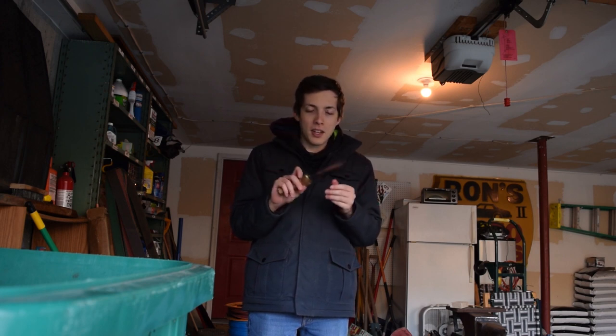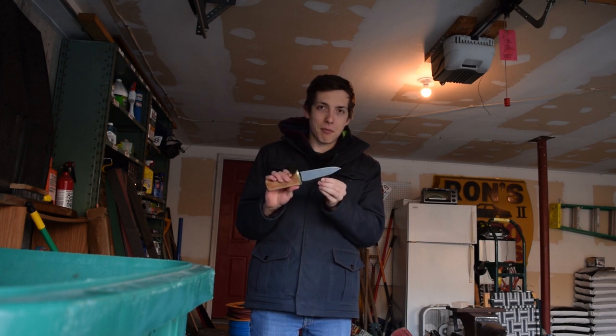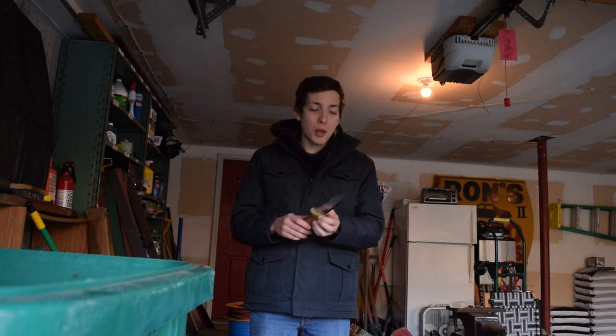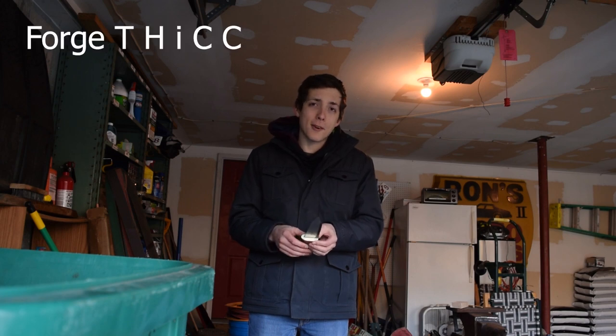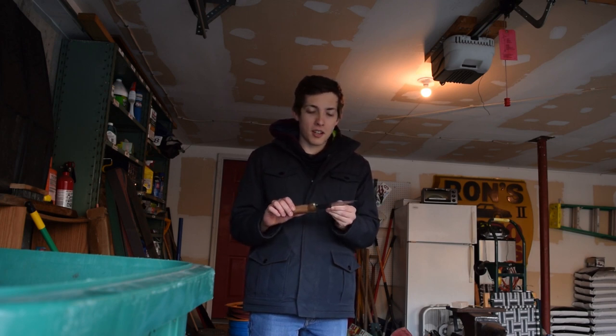I'm going to call that a wrap. I'm very happy with how it turned out, despite not going exactly as planned. I got some more tapering towards the tip than I originally intended — because I botched the quench with an extra thin blade that ended up warping, I had to grind way more material off the blade during post-quench grinding than I would have if I had just left the blade thick. So the lesson learned through failure and experience is: forge thick and grind thin. That's especially important when you're heat treating a steel you've never made a knife out of before. I hope you enjoyed the series; if you didn't see the first two, make sure to check those out — it covers the forging and the process before everything in this video. Although this is the end of the plow edge knife series, it is not the end of making sharp, pointy things out of the plow edge. So stay tuned, make sure you're subscribed, and I will see you guys next time. Goodbye.